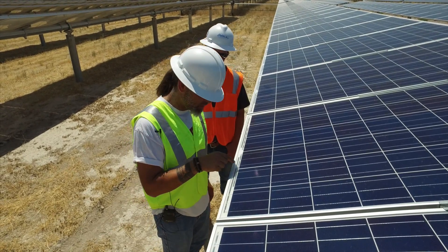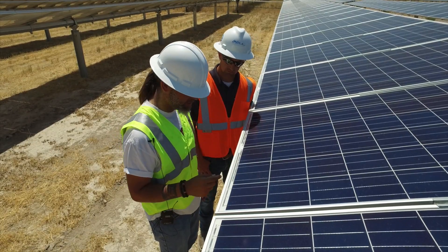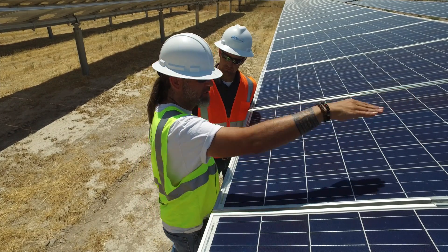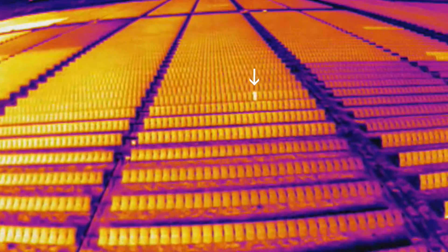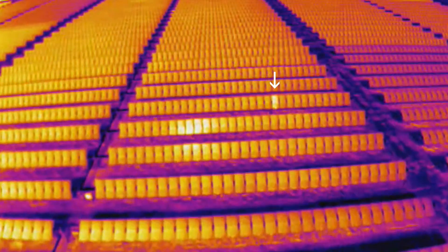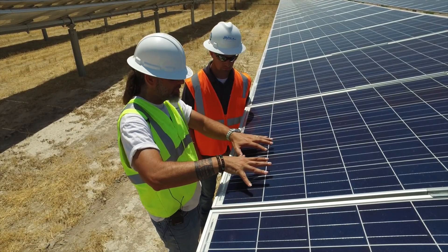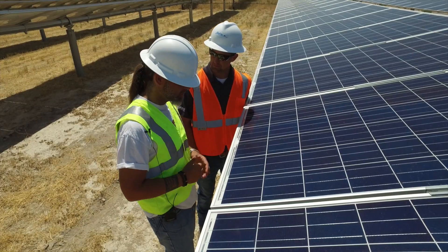Looking a little closer, as discussed about smacking the cells or carrying them around, you can actually pop these little solder joints. Since all of these panels are in series with each other, a failure could affect all single rows within that single panel. You can have a whole row or sections of rows affected by joints coming in together, and as they come out of the back of the panel, a half section can go bad because of just one broken solder joint right there — something so simple.